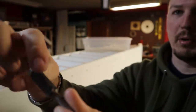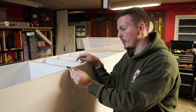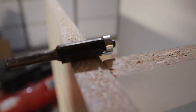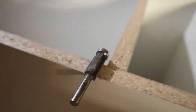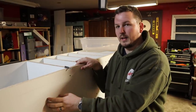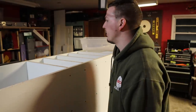The flush-cut bit is just straight and lines up perfectly with the bearing. I set the cutting depth so the bit covers all the way over, overlapping both edges, and the bearing rides down the face of the shelf, giving me a perfectly straight cut even with the bottom of the shelf. If for some reason the ends aren't perfectly square, this takes care of that too. It makes a serious mess, so I'll have to move the camera way away. Again, it's below zero outside so no good there.